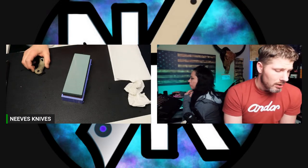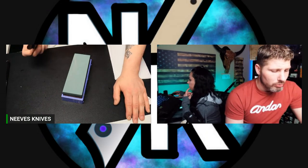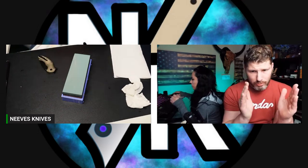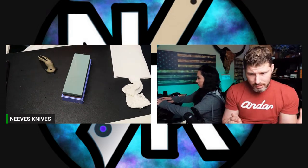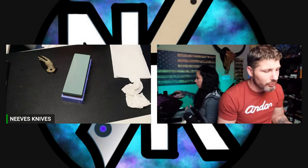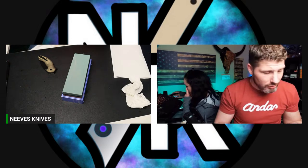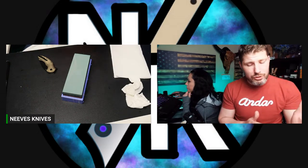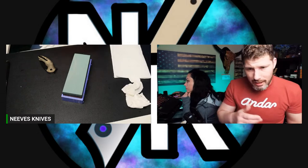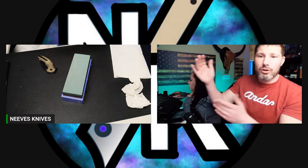So as far as what stone you should use, for a coarse stone, you should always start out between 150 and 300 grit. That should be your starting stone always. The only time you would want to start higher than that is if you're just honing. So that would be your first stone. Your second stone would be between 600 and 800 grit. And then after that, 1200 to 1500 grit. So on and so on and so on.